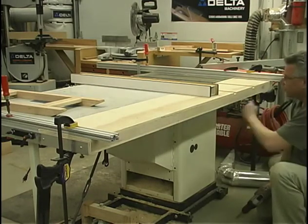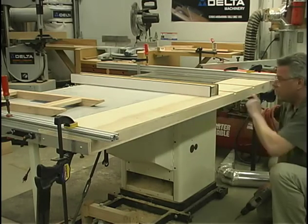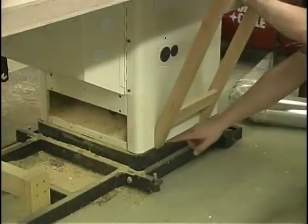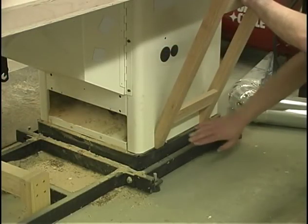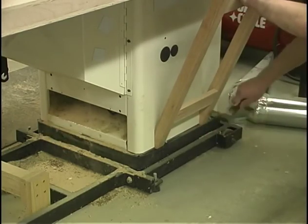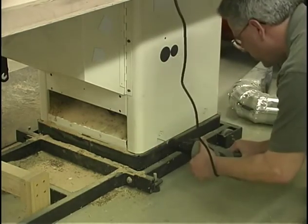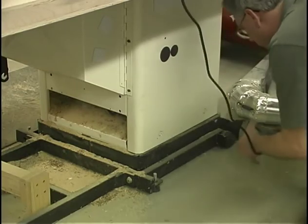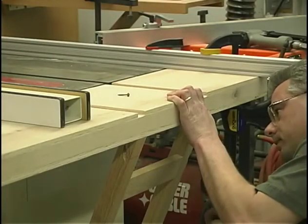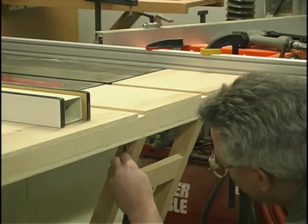Now before attaching your cross bracing, tighten up the sheet metal screws that are going up through the angle iron and into our fixed shelf. That will make sure everything's good and flat and aligned properly before we put in that diagonal brace. The sheet metal screws that I'm using are not self-drilling, so what I need to do is transfer their location into the sheet metal, and then I can pre-drill it. Using an 1/8 inch drill, we can finish up the holes. And we can tighten up the pocket hole screws on our diagonal brace to complete the installation of the fixed shelf.